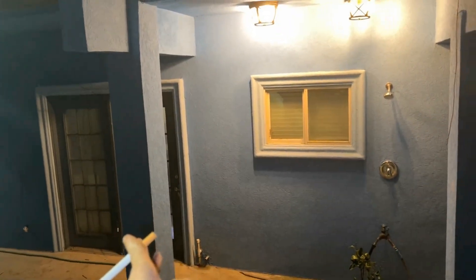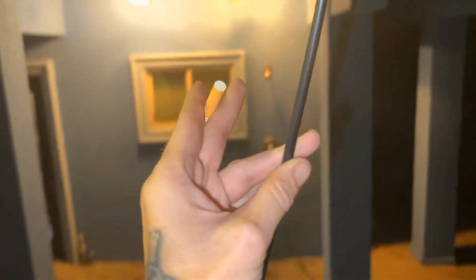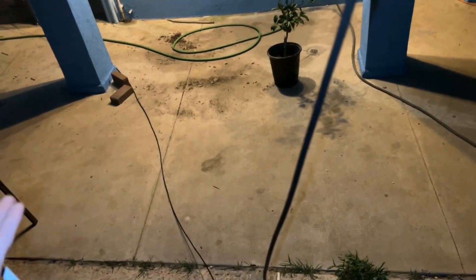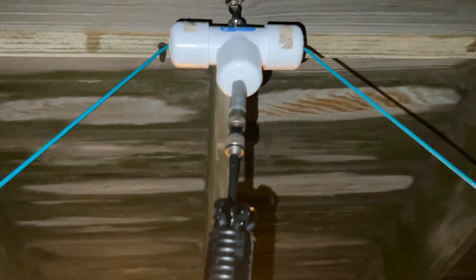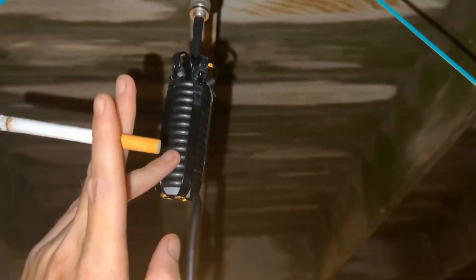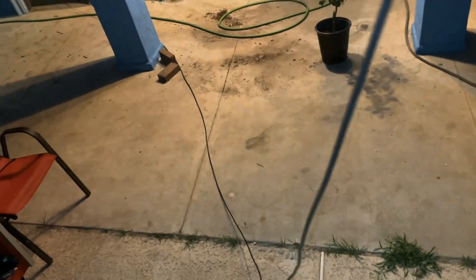The reason for that is, if you put this over by the radio, then it is going to use all this coax as part of the antenna — basically as a ground radial. But a dipole already has its own ground radial. This is my ground radial right here for the dipole. So I put this closest to the dipole, which isolates all this other coax cable and keeps it from being included in the antenna system.